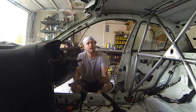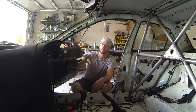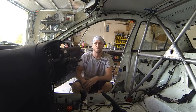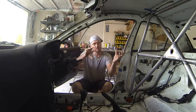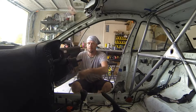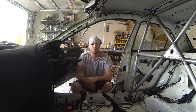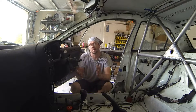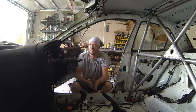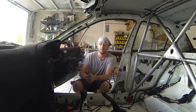Another reason I avoid it is because oftentimes with a small car like this, or a semi-complicated chassis, it makes it very difficult to get the entire hoop slid in through the dash and get it all set up and fit correctly. You take the chance of damaging the dash, and that's not something I usually like to do.